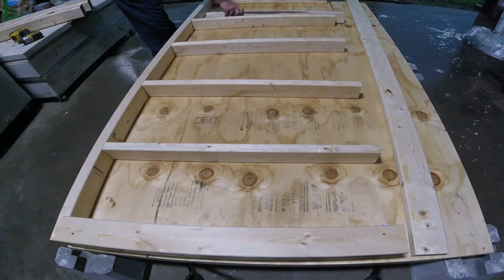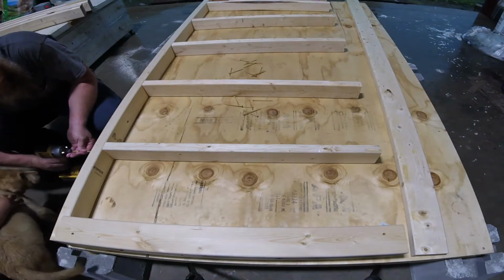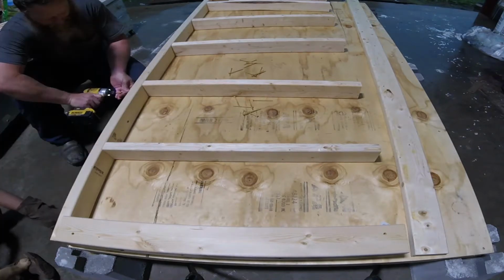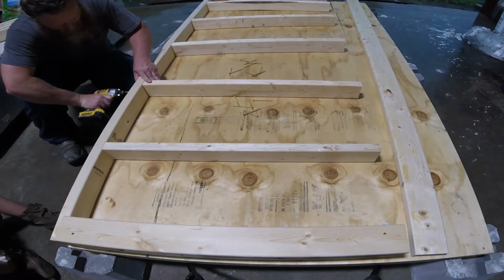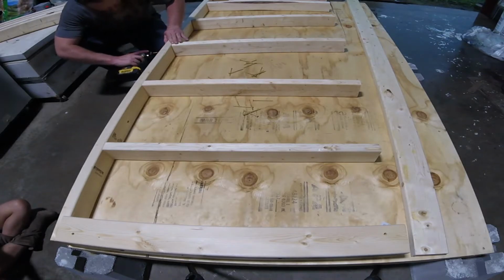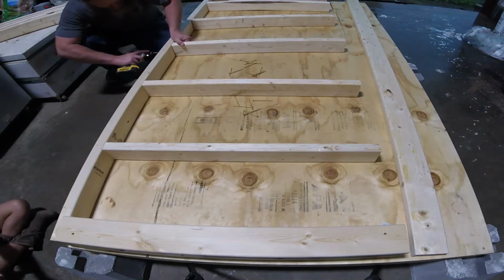Here we laid the boards out. I ended up just starting on one end and putting them on 16-inch centers, and then the last board I just let it land wherever it would. If it was close to the corner or a little over 16 inches, we just let it ride like that. It is a doghouse build after all.